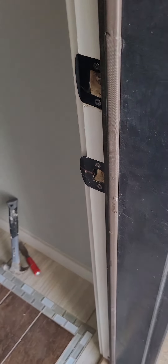I'll take off the deadbolt, open it, and you can see — all we did was go ahead and move this an eighth of an inch in this direction so that it could catch right here in this strike plate.